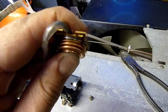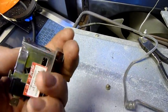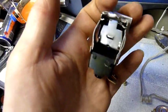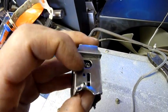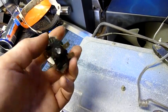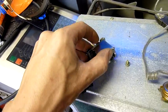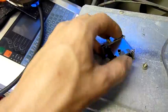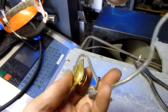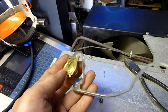That's the pressurized bellows that expands and contracts under temperature differential. It's still got a gas charge in it, probably just not enough to trigger — I probably could have recalibrated it, but it doesn't matter, I've got plenty of them. There's just a lever in there — it's actually just a sealed switch. That spring has a screw through it so you can tension it down and recalibrate it. I could almost put that back on if I straighten the housing out and bring it back into range. That's the average small thermostat for you — nothing too complicated, just a single contact and a temperature-dependent bellows assembly.